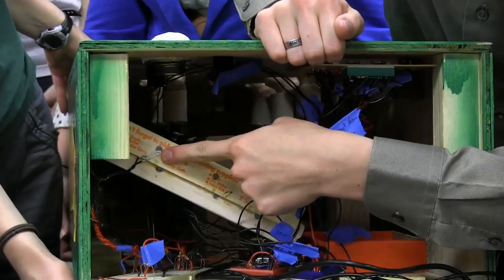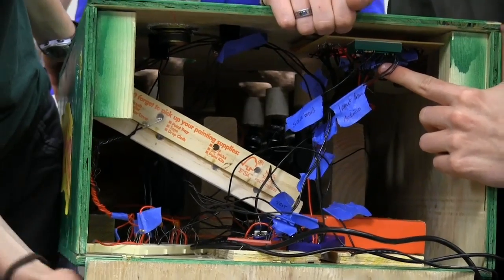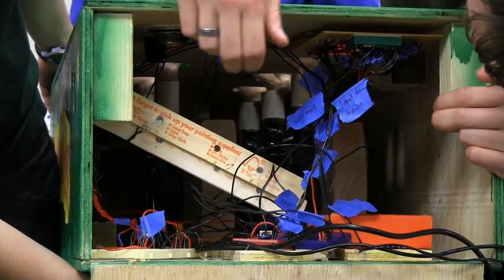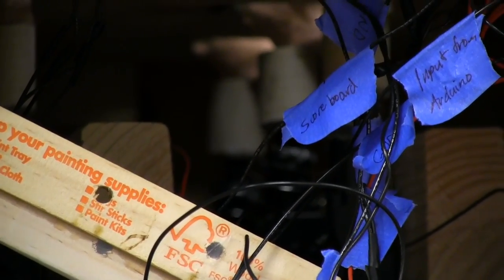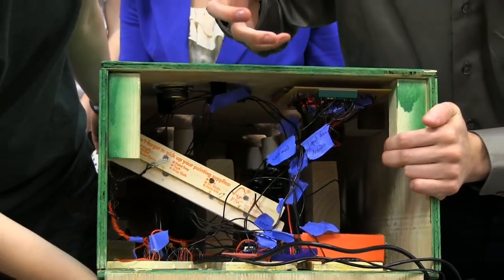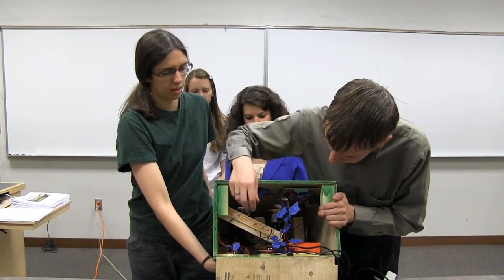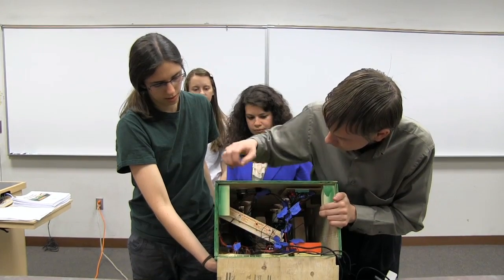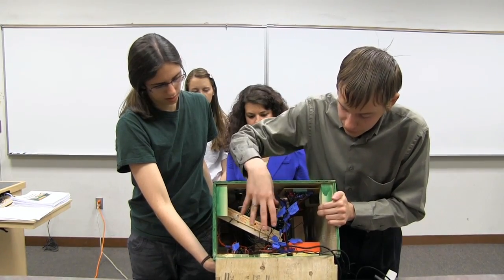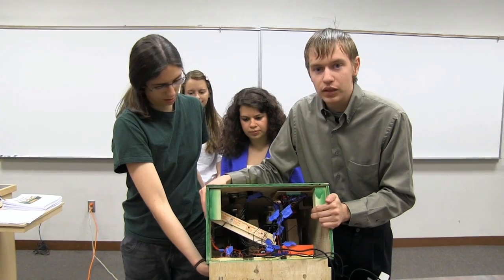We've got our coin rail here with the IR LED and a transistor on the other side. One PIC over here runs the scoreboard by sending signals to the op amps and then to the seven-segment displays. In the back, we've got five solenoids for car power door locks, with a wooden dowel and spring glued to them — current through the solenoid makes them go up, and stopping the current lets the spring pull it back down. Another PIC runs the coin detector and start button, telling the Arduino the credit state and whether it's time to run. The Arduino handles the speaker, turning on the solenoids, reading voltage from them, and powering the LCD on the front.